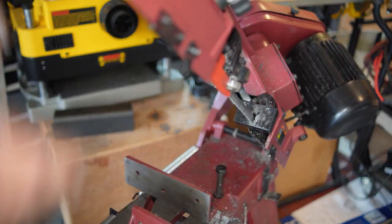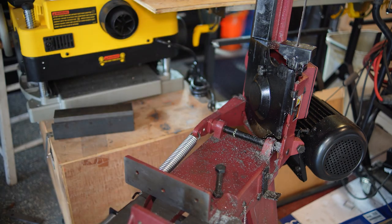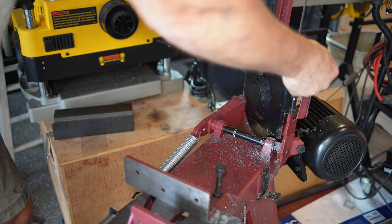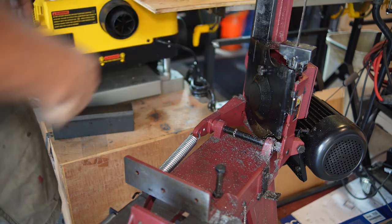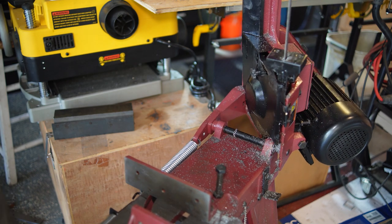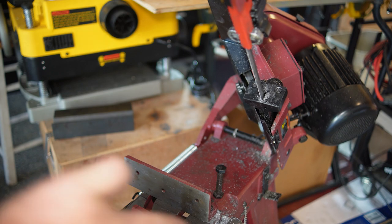So that's the introduction, and now we're actually making the parts. I also did a complete tune-up of this saw — made sure everything was cutting square and true. It's quite a lot of work, and I'll show the adjustments I did later in the video and how I tested the cuts. I got it within about 20 thousandths of an inch in both vertical and horizontal, which is pretty darn good for this not-perfectly-constructed saw. So let's get on with the build.